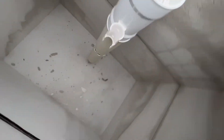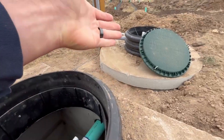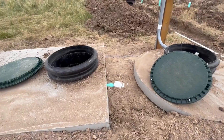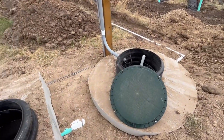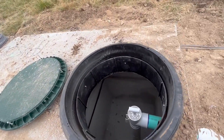There's some anaerobic digestion happening. We've got holes in this pipe, so all the water that starts filling this thing up comes here and then overflows to a tank that's a little bit lower on this side. The lower tank will collect all of the liquids. All the solids will get pumped out of here every three years or so.